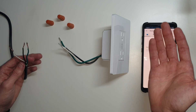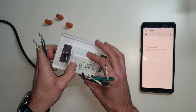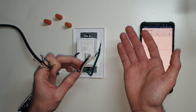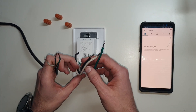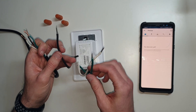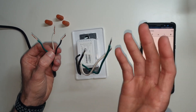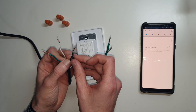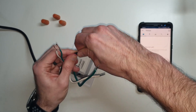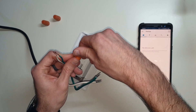Now, let's go ahead and hop into this. It's a standard 125 voltage — a house can range but it's going to be 110 to 125 volts normally. You've got your hot wire, the black wire; your neutral, which is the white; and your ground, which is the green. It is just as simple as matching up the wires. You want to make sure hot with hot, neutral with neutral, and ground with ground. Give it a twist in the direction that you're going to twist the wire nut so that it doesn't untwist the copper off of it.